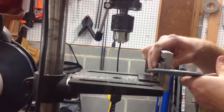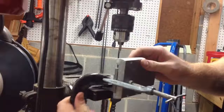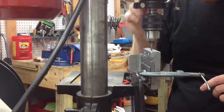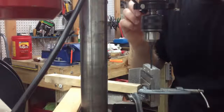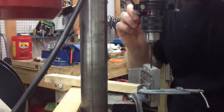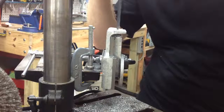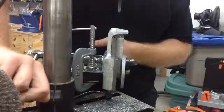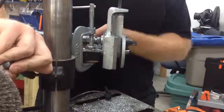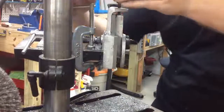After I mounted the clamps, I needed to drill the holes for the jib adjustments. Fixturing these parts was really a challenge with my small drill press. I ended up using some angle iron, a bunch of C-clamps, and even some wood pieces just to give it stability. After I match drilled with a smaller drill bit, I used a larger drill bit to open up the compound slide, then used a tap fed through the compound slide to tap the compound swivel base for the compound feed screw.